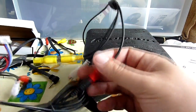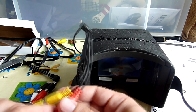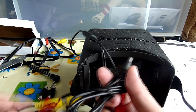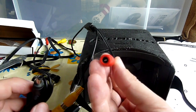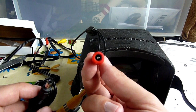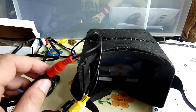The cable it comes with is very neat. It has a video in, an audio in which I guess you don't use, and a little power socket. It comes with an adapter lead to a JST, so I'm just running it off a little 3-cell 850 pack. I've also tried it on a 2-cell pack - it's just a 5.5mm 2.1 barrel connector, the same as the Fat Shark goggles use, and it runs fine on 2S as well.